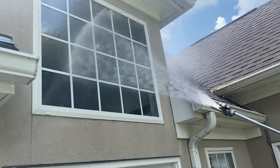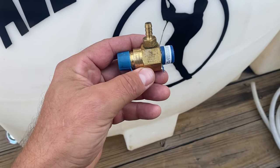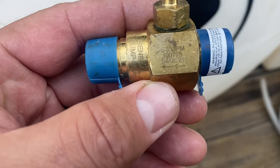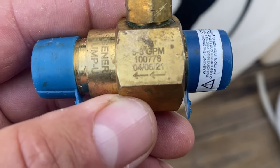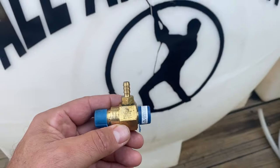Also, downstream injectors are only one way, and there is an arrow on the injector that goes away from your pump and towards your gun. If you put it on backwards, your pressure washer is still going to work, but your chemical injector will not be able to pull anything from the chemical tank. So always make sure the arrow is going in the right way.